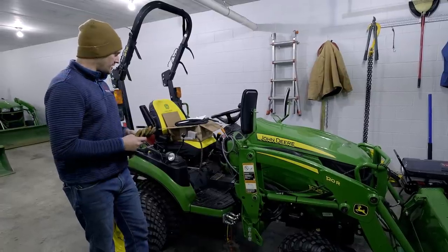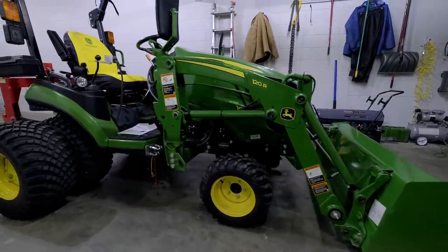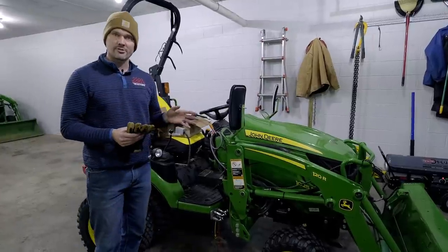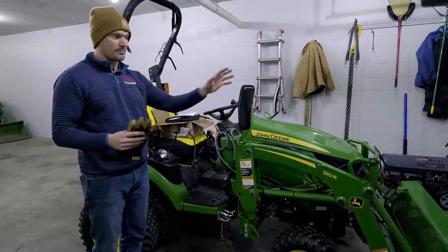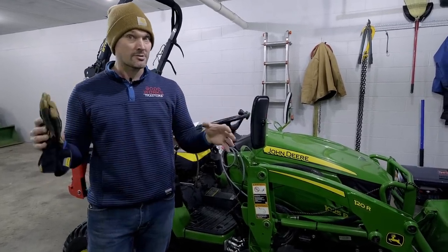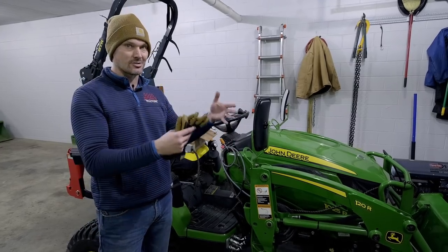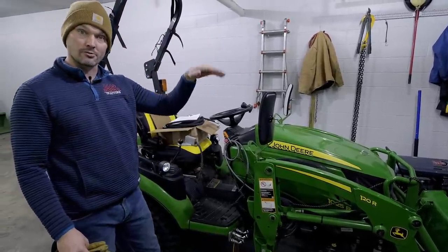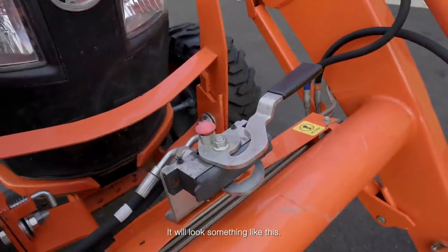This is my 2018 1025R. This handle is part of the electric kit I have installed for the WorkSaver grapple up front. I'm going to try the hydraulic version now that there's a cheap alternative. The electric version runs about $2,000 and the hydraulic version is about $1,500. If you're going to run a hydraulic grapple, you need additional hydraulics beyond the standard loader hydraulics — to open and close the jaws of the grapple, you've got to have a third function. That's where this diverter kit comes into play.